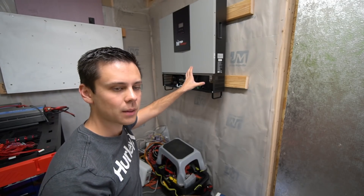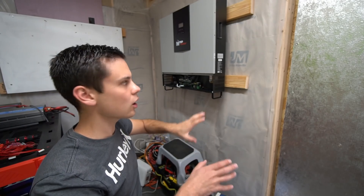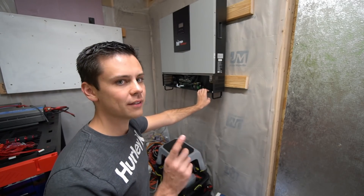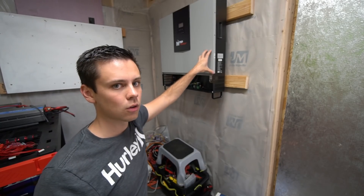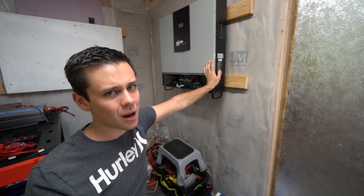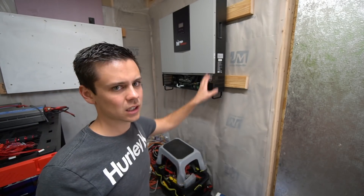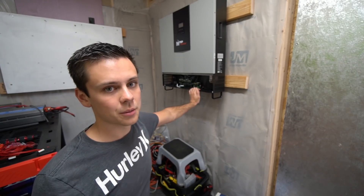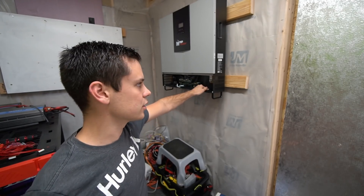I just got a 48-volt battery and we're going to add it to this 48-volt inverter. It's very easy to use — you just connect the battery and you have split phase output. You do have to change one setting but it's super simple. If I was going for only one large inverter with a 48-volt battery, it would probably be this one. There's not much difference between this inverter and the new GrowWatt — the GrowWatt has a slightly different screen and a couple other options but they're not that different. All these MPP and GrowWatt inverters are made by Voltronic, so you're not getting anything special either way. What you do get with the GrowWatt is a better, easier-to-read manual and a parallel communication board.